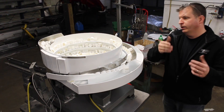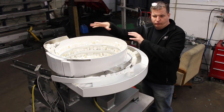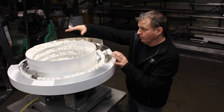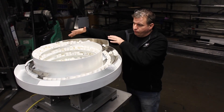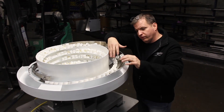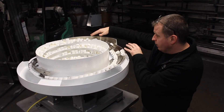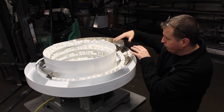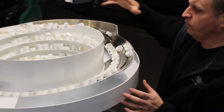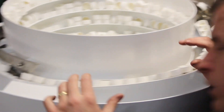Every feeder bowl is built for the application. Look at the tuning in this section — I want to go over and describe what it does. In this area here on the bowl, when a bowl is designed, they'll come out into the pull-out area, which takes your bulk parts, brings them out, and breaks them into multiple lines of tracks, which you can see here. This area is what we call pre-selection. We get them into multiple lines and get your rate up to the rate you need.